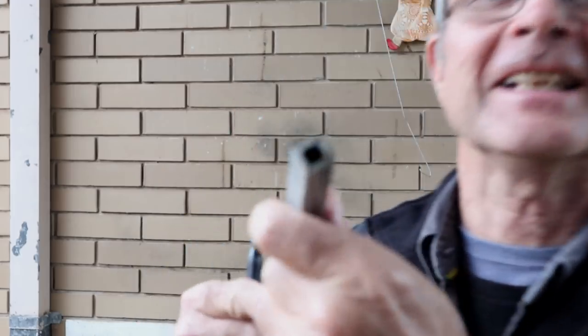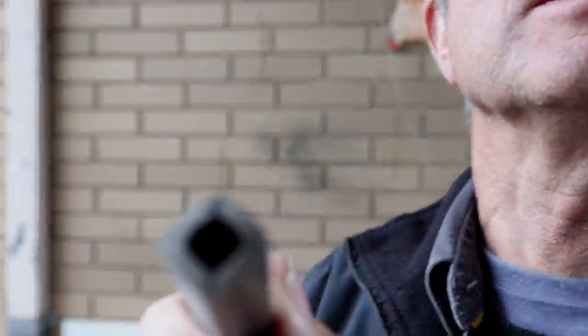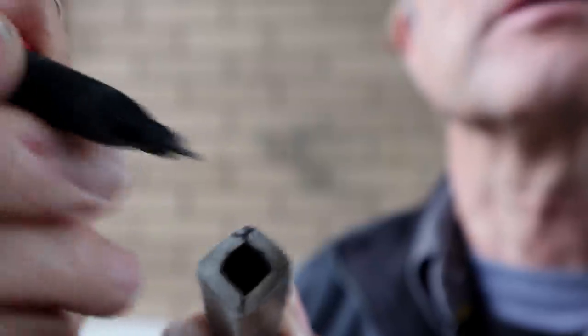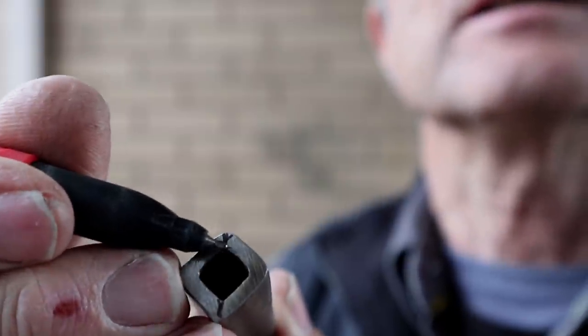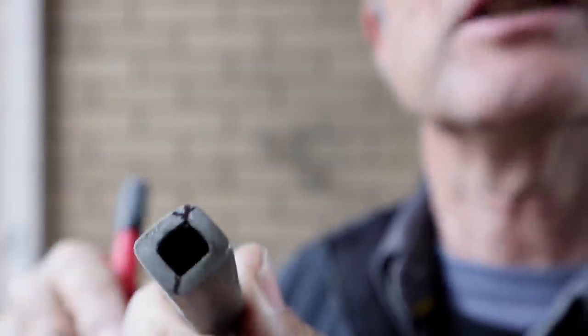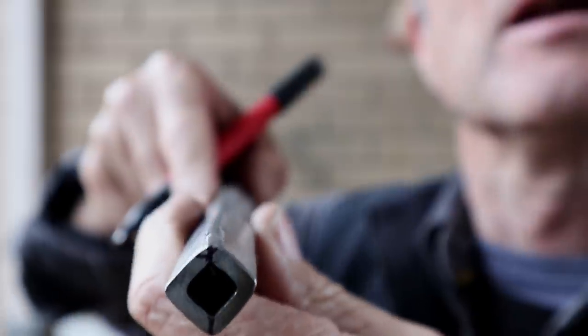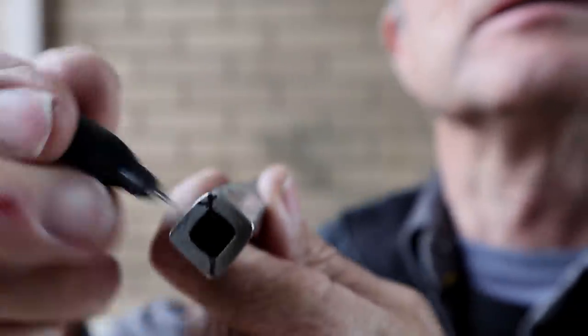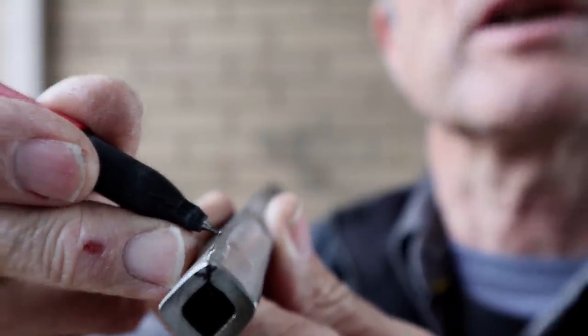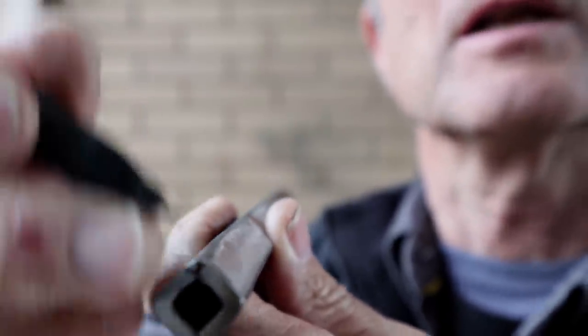I didn't recess in on the weld, so we'll get clear. I've just drawn a texture mark through, imagining that's where the join was. Now to recess in is like this top, you want that groove, so you would have just ground each piece down, and that lets you, when you run your weld along the top, get down in that valley and get a good bite on both pieces.